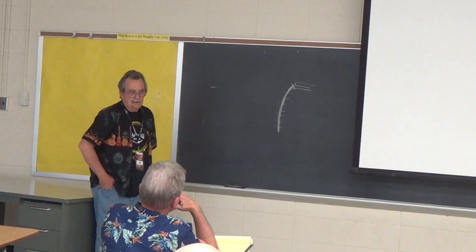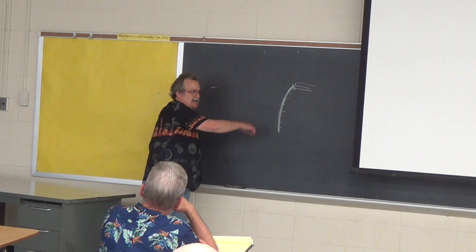Now, the first one I did, I took a pen or a pin, and I just kept scratching until I got a decent line, and then I came back, I have a Craftsman set. They have two real fine Dremel points, and then I just gently kept scratching it until I could see my line, and then I freehanded it. But making yourself a template will help you to close that up pretty nice. Now, when you're building a white guitar, if you get the lines off a little bit, you can always sand your neck to match your mistake.